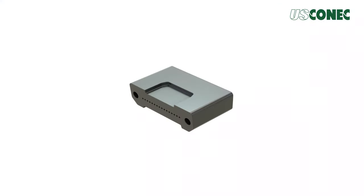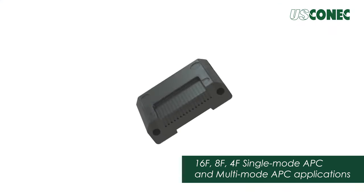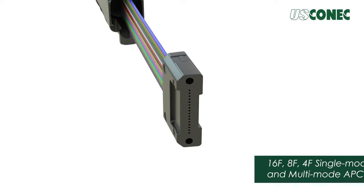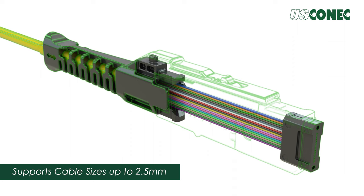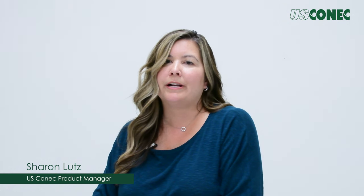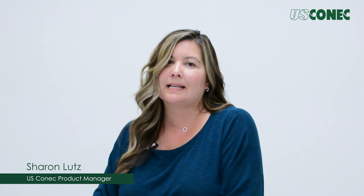Suitable for 16, 8, and 4-fiber single-mode APC and multi-mode APC applications, the MMC connector is easy to assemble and supports nominal cable sizes up to 2.5 millimeters. The MMC connector and TMT ferrule technology usher in a new era of extremely high density, low insertion loss optical connectivity for next generation link designs.